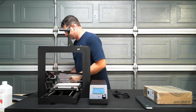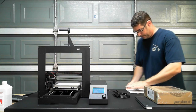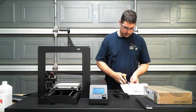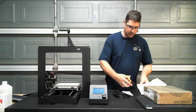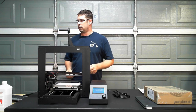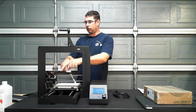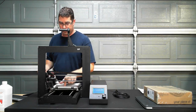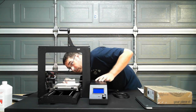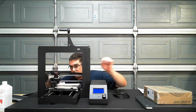I'm going to, now that I no longer need these instructions, cut myself a strip off there. Vertigo Grey is right. It is beautiful. I don't need to do the M119, Ryan, because it successfully homed and all of them tripped this time. But I do need to power it back off so that we get free motion here. And let's find out how far out of level we've knocked this thing.